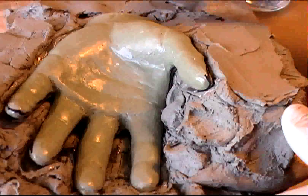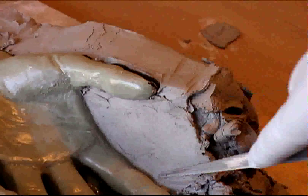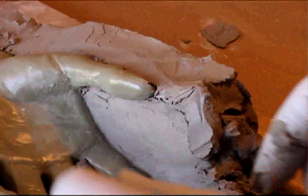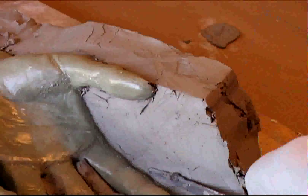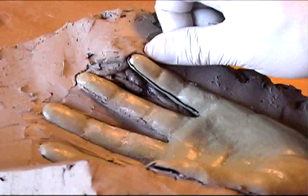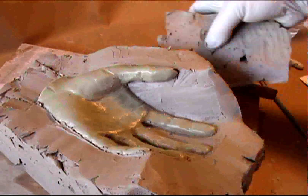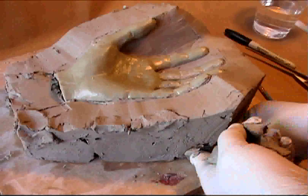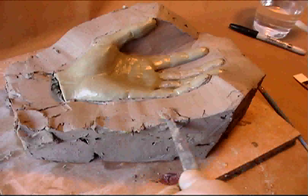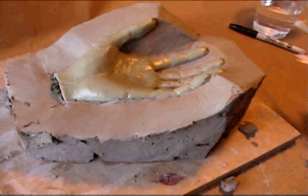You can just start packing the clay around your sculpture. The idea is that you take your clay and get it all the way up to that black line that I drew with my Sharpie around the sculpture. The idea is that we're going to build a box around this, fill the top side with silicone, and the clay is representing the second half of the mold. So if we make this side look nice and pretty, then our molds are probably going to fit together very well.